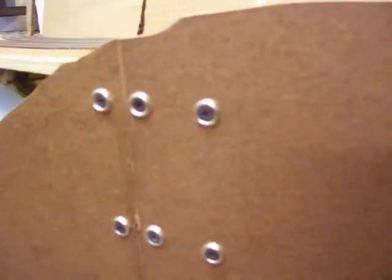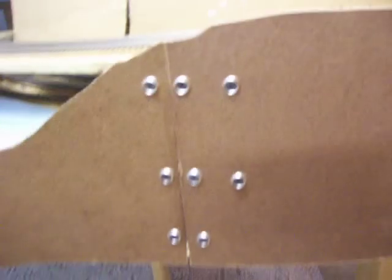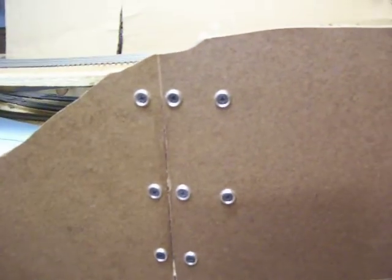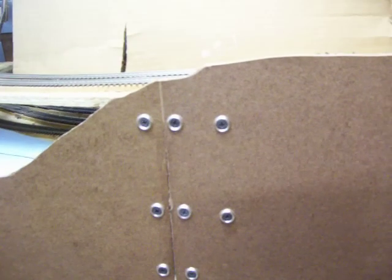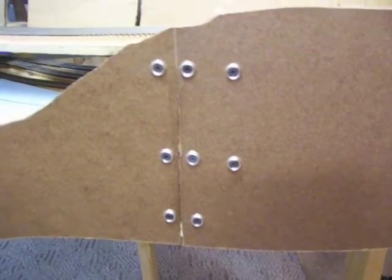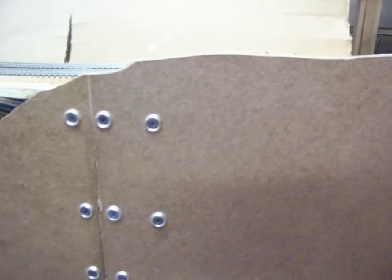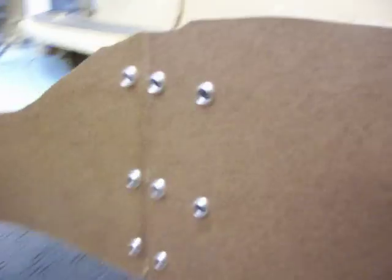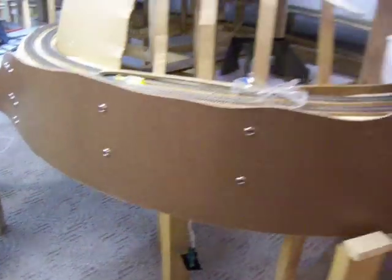What I did use was finish washers and just some drywall screws, then screwed them into the outriggers. This section here you can see there's a seam — that's around three pieces on each side; I overlaid the pieces and used some spring clamps, clamping them together. Used a small trim saw — circular saw — cut them simultaneously so that the pieces matched. Then I just put a glue backer board behind it. The finish washers really hold it in place — worked really well. Once it's painted, I think that'll hide in pretty well — you won't see it at all.